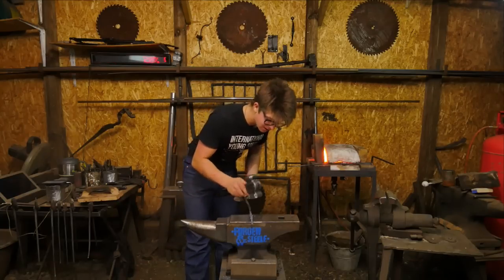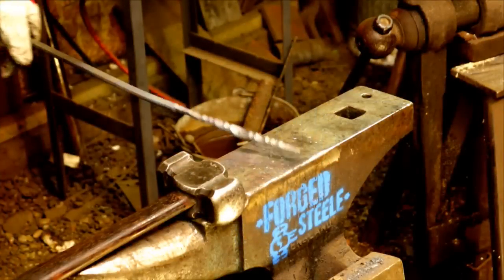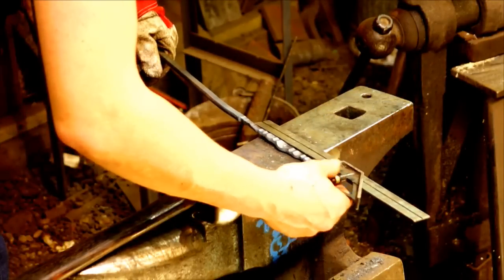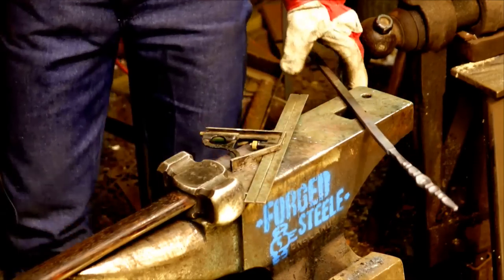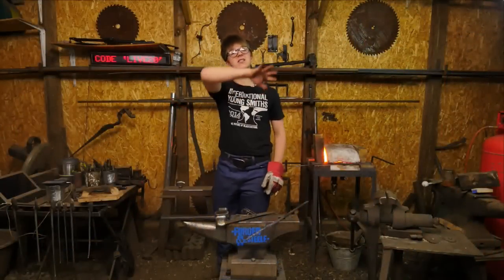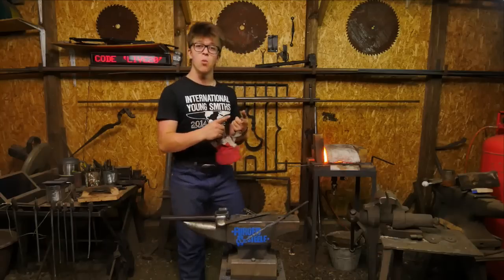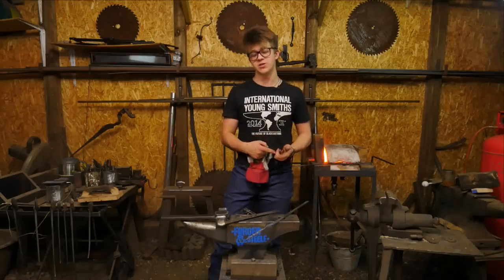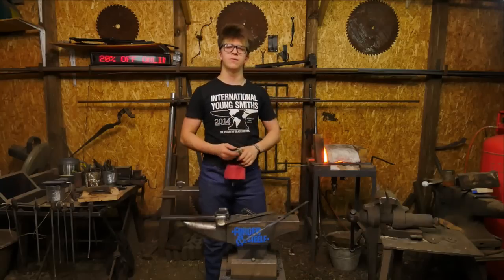It is also due to the fact that the blade is very thin, thanks to its design. I mean, it's a very thin blade. And there's one other reason. I knew there was another reason. I'm getting distracted thinking about measurements rather than thinking about the workpiece. And it has this curved edge, which further reduces the surface area contact with the material, meaning that number one, your hot cut edge is not going to get as hot, which means that you're not taking as much heat away from the steel. And number two, there's less surface area contact resisting your blow as you forge it.